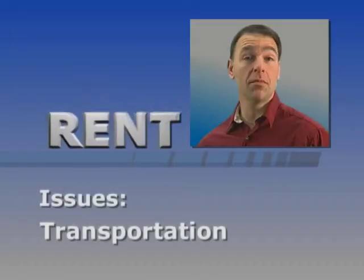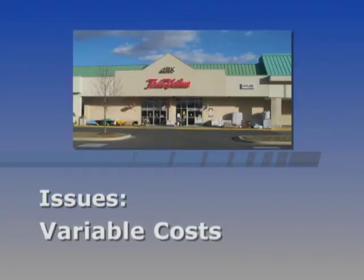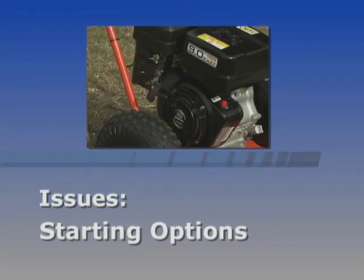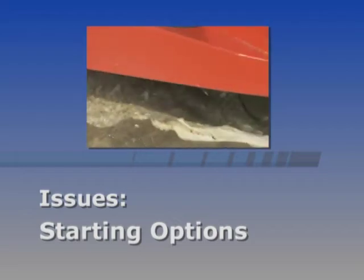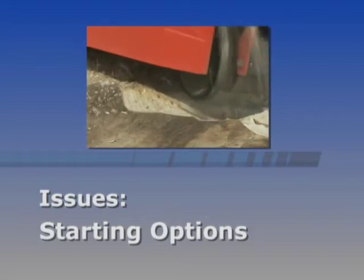Renting is somewhat convenient, but you have to transport the machine or pay extra for pickup and delivery. Prices vary, generally falling in the $125 to $500 a day range, depending on region, style of machine, and transport arrangements. Make sure you see the machine before renting. Rental shops will often try to get as much life out of their equipment as possible, and there's nothing more frustrating than renting a clunker. Be aware that rental shops prefer manual starting for smaller machinery because it's easier to maintain. Stump grinding is the type of work that may require a lot of restarting, so if you're not up to that, inquire about electric starting options.